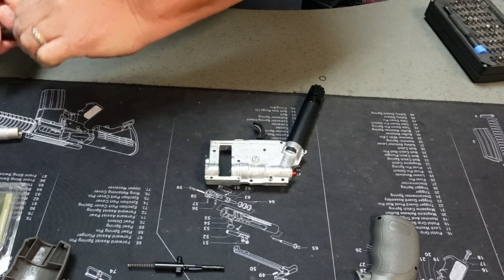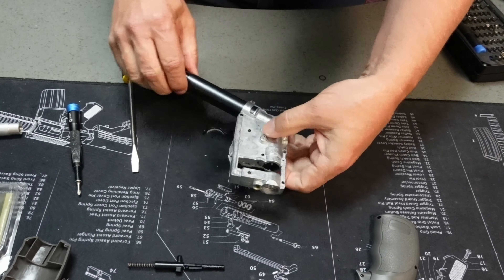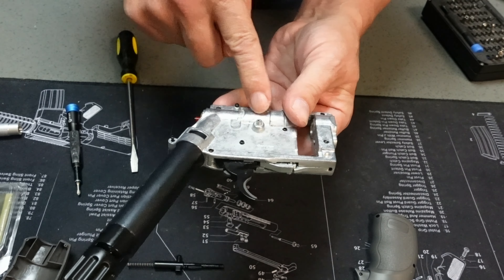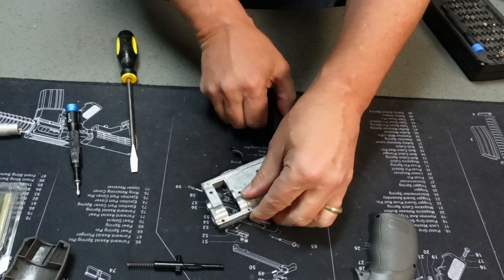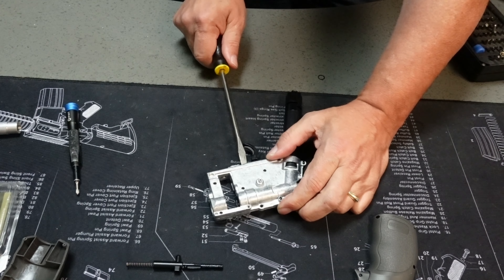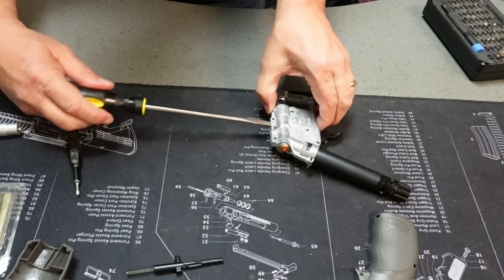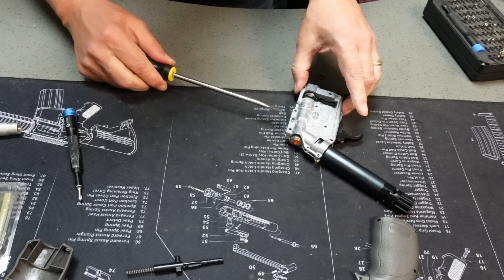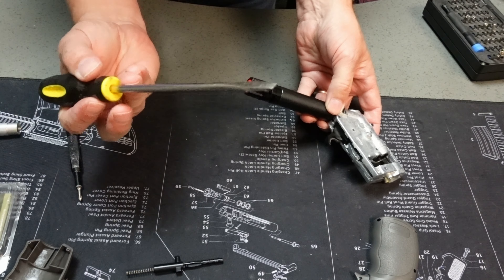Once we've got all that out of there, take a large flat-tip screwdriver. If you look up in here, you can see there's a seam between the top of that trigger. The pin right here is what's holding the entire top and bottom of the mechanism together. Unlike on an HTP-50, on this one when you pull it, you can see there's a lot of moving parts, so you want to do this nice and slow. Take your screwdriver, put it up under there, and kind of pry gently left and right, up and down. Move down the side a little bit, come into the back, and just a little at a time — you do not want to go fast with this. Make absolutely sure that trigger and this mechanism stay down and against the bottom of the body.